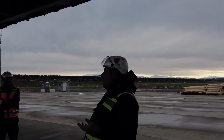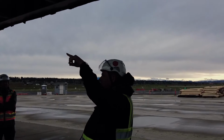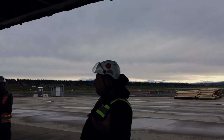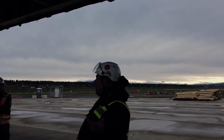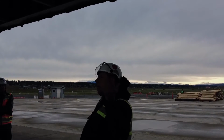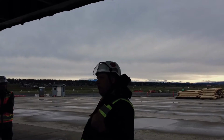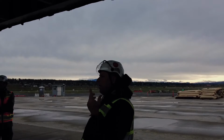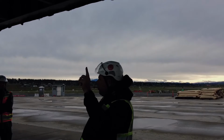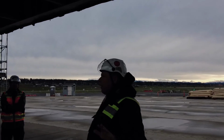For regular points of maintenance or things that you would need to access, you would either be in the penthouse where all the control panels are, or at the fixtures themselves. So ideally, you never have to get above the lattice. At some point you will, but for most regular business you don't. That's good, because the more times you take the lattice off and unscrew it, the more it wears out the wood fibers, and eventually you'll have to replace it with a longer screw or some other mechanical fastener. That part we can talk about later.